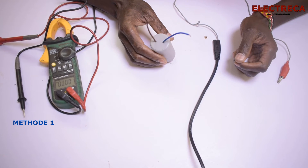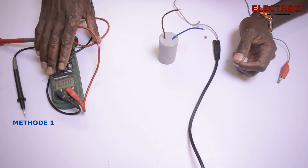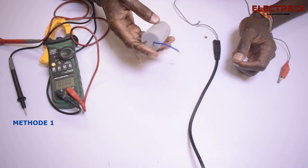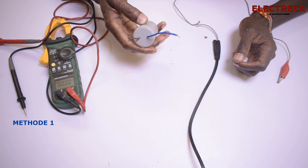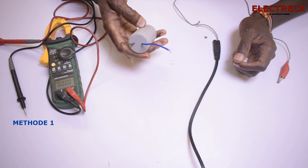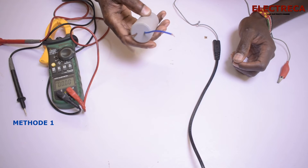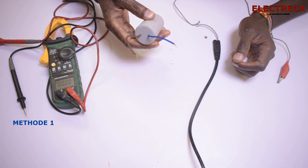When we tested with the multimeter, it showed us that this capacitor is okay, because we were able to read the capacitance accurately. By the way, this is also how you can identify the capacitance of a capacitor in case you're not sure, or in case the markings have been erased off.